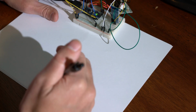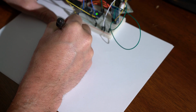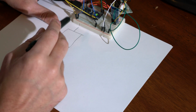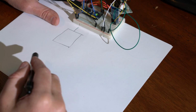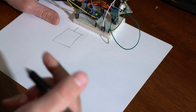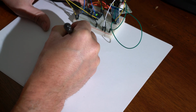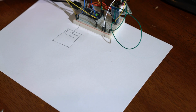So basically what we've got now is the Arduino with some code on it, and the basics of that code is if you send some letters to the input into the serial of the Arduino, it will output to the motor through those pins a certain amount of steps. And the chap from Crazy Logic, he had it set by default, so if you send L to turn the motor left, it would be 2000 steps, and R would be 2000 steps. Now this motor is 4000 steps for 360 degrees, so roughly, if you divide 360 by 4000, it's 11, I think, is it?